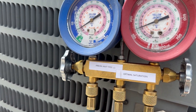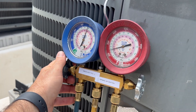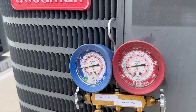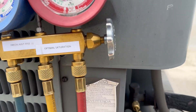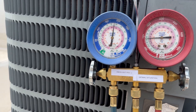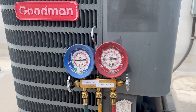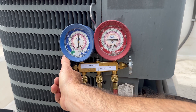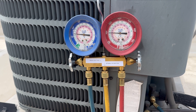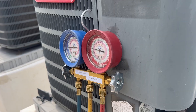Once you see liquid you know you're good. Now let's charge. I don't have a charging attachment so I just threw quick spurts — I don't want to flood the compressor with liquid even though it changes state pretty fast. Quick spurts. Just like that — I hear all that rattling went away. I'm going to get my saturation just above 30 and then we can dial in the charge a little bit.